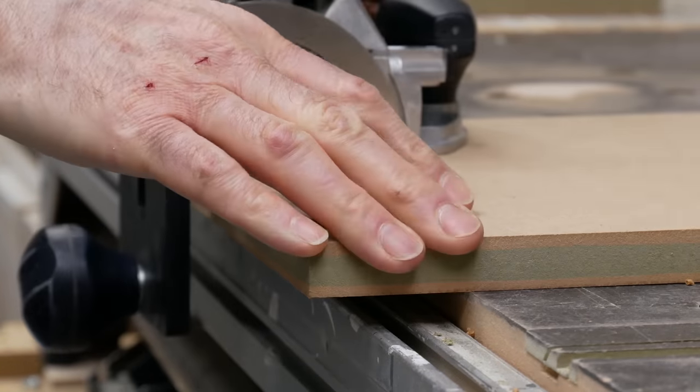This isn't a super strong connector. You can add glue in there for a permanent joint, but you do need to handle it carefully until the glue's fully set. The Tenso connector is around 70 pence per joint, so about a fiver's worth for that carcass just over. These two connectors — in particular the Peanut and the Tenso — are the kind of thing you could use if you needed to flat-pack something for home assembly by the customer, because they're both very simple and hard to go wrong. But I'd include a sachet of glue in there as well if I was just using the Tensos.